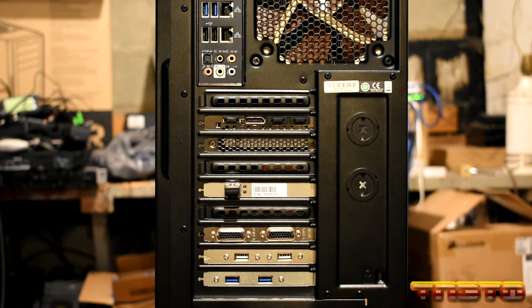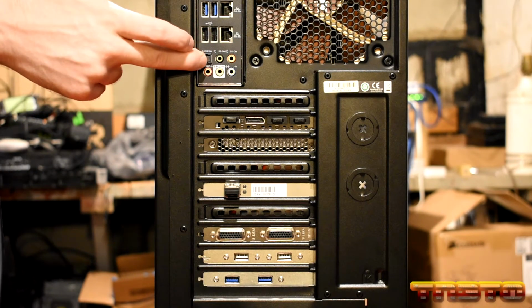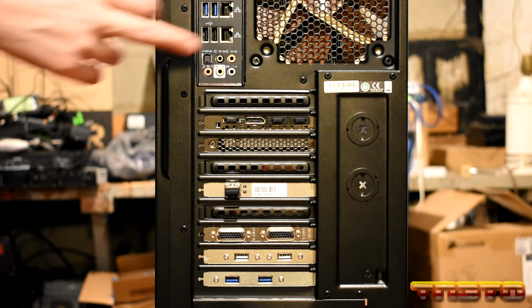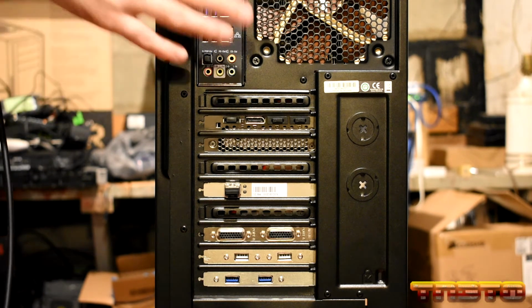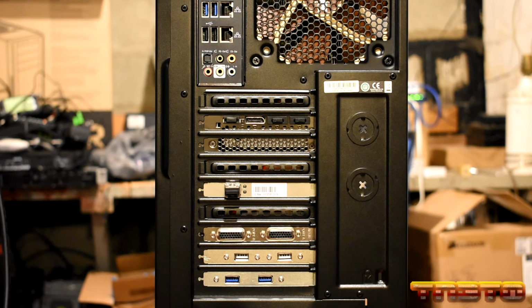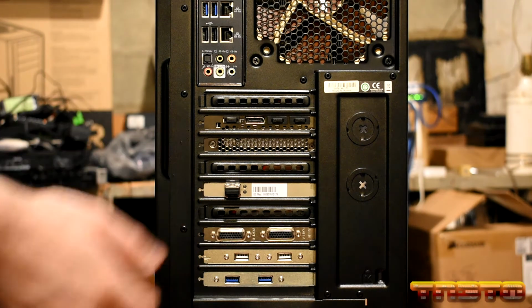Pretty dope. Like, oh, why don't you use SPDIF or whatever's on here? Well, you'll be using the Realtek controller and Realtek's poor software to mess with stuff. And plus, Toslink, the jitter on Toslink's not the best. This SPDIF on your motherboard's nothing compared to a professional digital audio interface using AES/EBU.